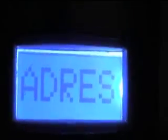So I go into the address of the second one, and I hit in the 17, and okay. There we go, I've set it to 17, so both of those are set to the right address. Now if you had a third scanner, you connect that up to 16 channels apart from 17, which would be 33, and so on and so on. And now let me just put them back up.